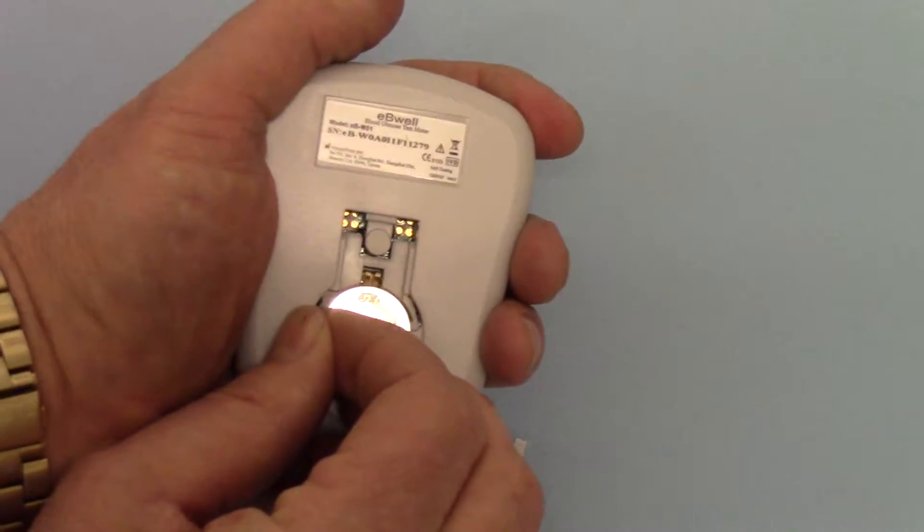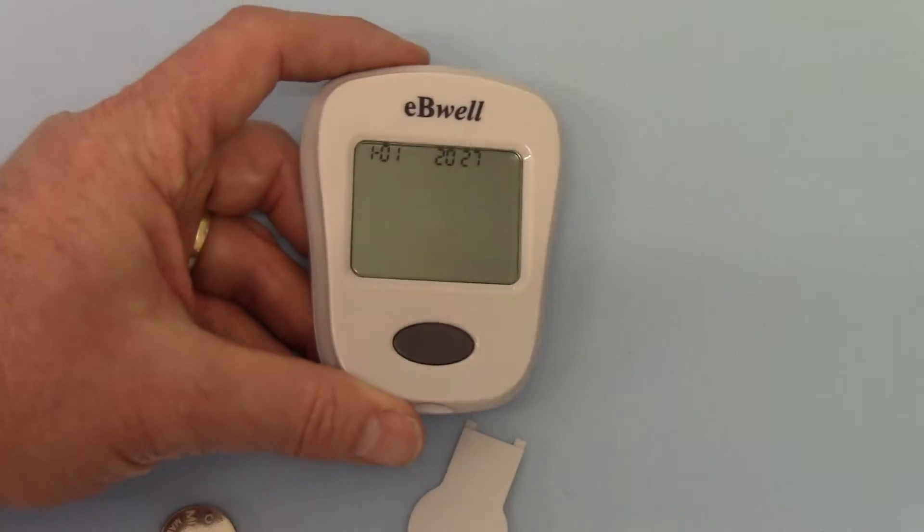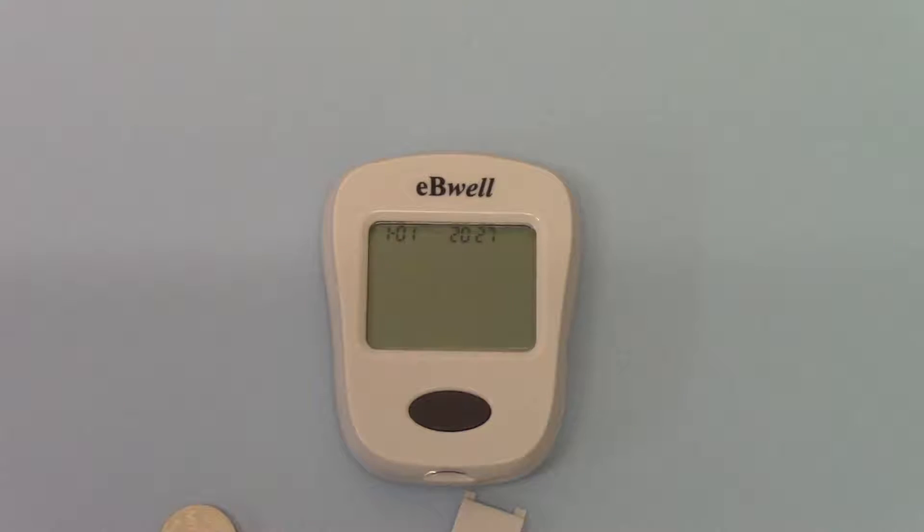What we're going to do is just remove the battery, and you'll see the unit still retains some power. The unit has a capacitor inside which takes some power from the battery so that if there is a battery failure, you will retain the memory information and settings and hopefully not have to do a complete reset each time. So if you find the battery power is being used and you need to replace the battery, try and do so quite quickly so that you retain all your memory information.